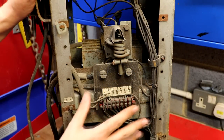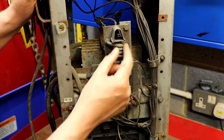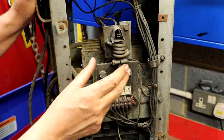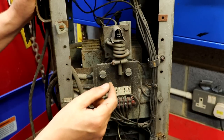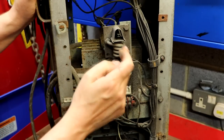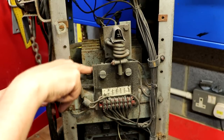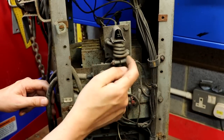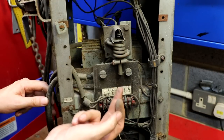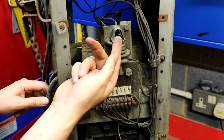Having removed the other side panel, we can see some electrical loveliness. My eye is immediately drawn to a very thick piece of copper wire wound into a coil, with some switch contacts at the top. I've never actually seen this before, but it looks as though this heavy copper wire is forming a solenoid — it's taking the output current from our selenium rectifier through this thick wire. There's another lead going onto a very substantial block of brass. I think this is some kind of overcurrent trip — as it draws more current it closes that contact, and I'm guessing that turns something off.